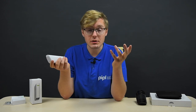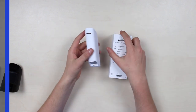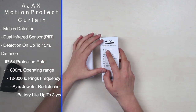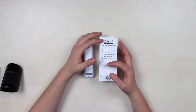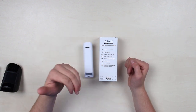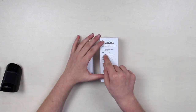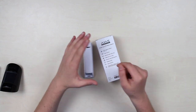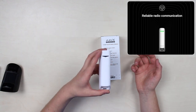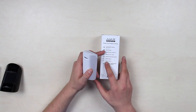Correlation signal processing is a must-have function if you have pets at home. Regarding features and specifications: motion detection distance operates properly up to 15 meters. The sensor has IP54 ingress protection and operates as far as 1,800 meters away from an Ajax hub, which checks sensor status as frequently as every 12 to 300 seconds. The Motion Protect Curtain is equipped with Ajax's unique Jeweller radio technology, and the built-in battery will last as long as 3 years.